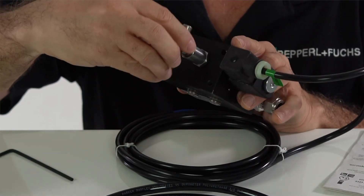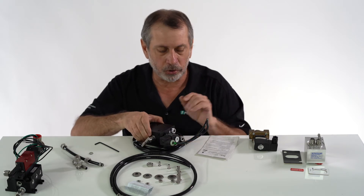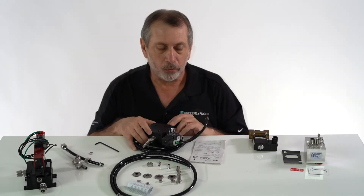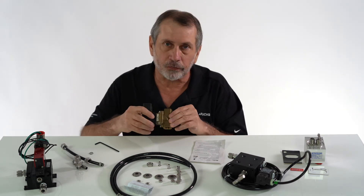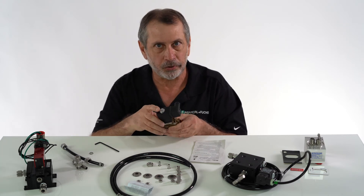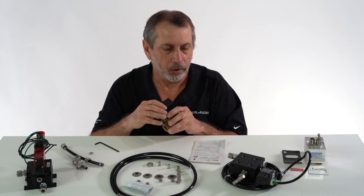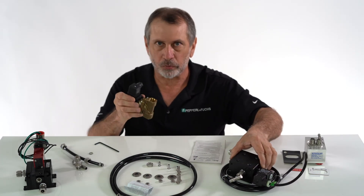You set your pressurization inside your enclosure and once the pressure reaches a certain value it will automatically purge your enclosure. This is a zone-rated system. This is a different coil than the UL certified one and you will get an instruction pamphlet for the certification of the system. We also have a third valve, which is also a zone-rated valve — just a different design. The needle valve is on the side and the digital valve is on the top. Hook it up to the 5500 or 7500 series and it will purge the enclosure automatically. The reason we have two different zone-rated valves is because this particular valve will be CCC certified for the China market — we are presently doing this system with CCC certification but it's going to take a little bit longer, so this one will be available now.